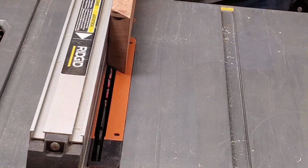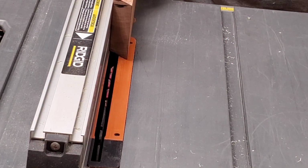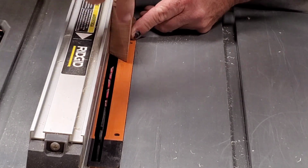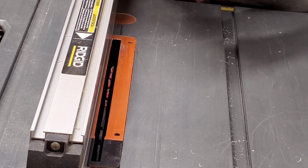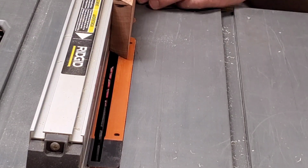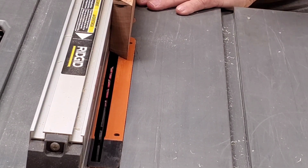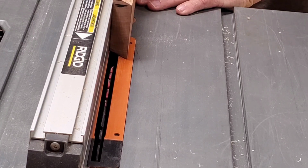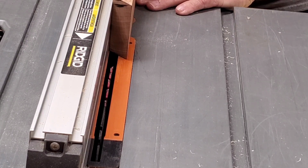All right, we're getting ready to make the first cut. We're going to take the blade and cut down this line, the depth that we want to go, and I'll do that on all 3 boards. Then I'll come back and change the setup, and cut the other portion of the rabbet, and then we'll have our shoulders that we need for the backer board to set in.